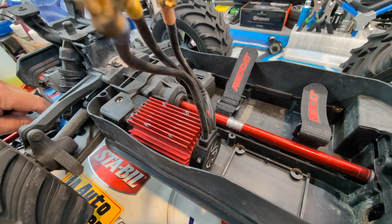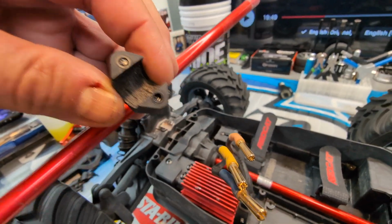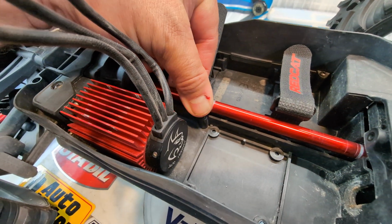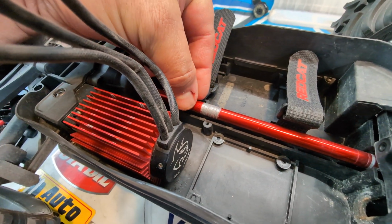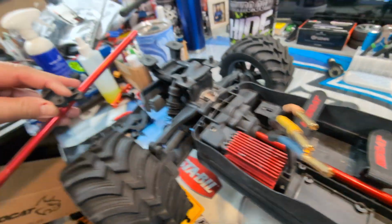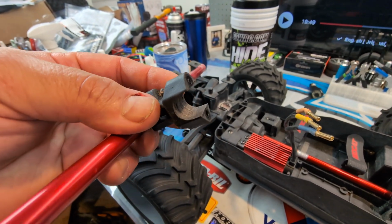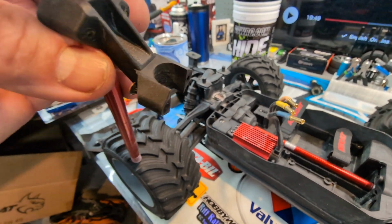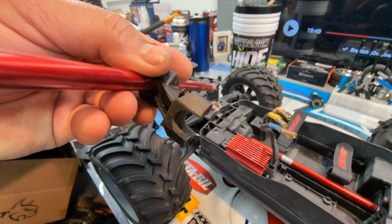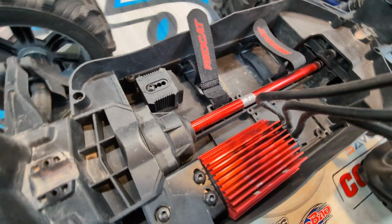And what it is, obviously, is this brace. It gets stuff in there, rocks and garbage, and really chews away at this drive shaft. So it almost needs O-rings or something on each side to go up against to hopefully prevent stuff from getting in there. Even a sleeve would help, but I almost feel like this needs to be redesigned a little better, because you do kind of need a chassis brace in the center. At least that's how they're doing it.